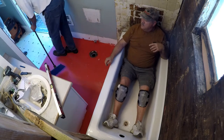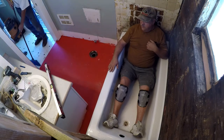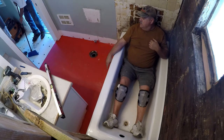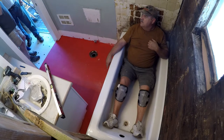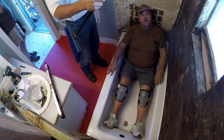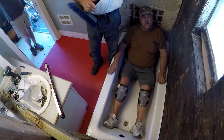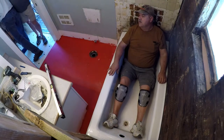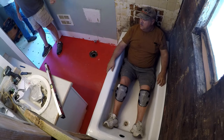You got the window order? Yeah, it's four weeks. You have the rough opening size? 33 by 21. I'm going to open this up a bit — I'm putting in a better window. Now you're going to have to put a header in and everything. No, no — it's exactly the opening, it's right between two studs. But changing the size of that window, the hard part is doing the siding. I think you just trim up the siding — don't even need to flash it on the top.